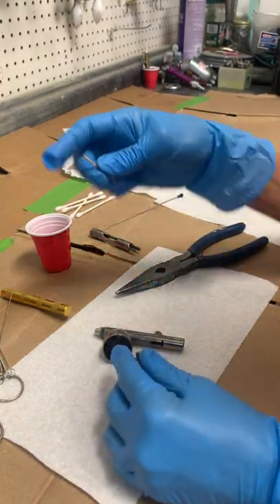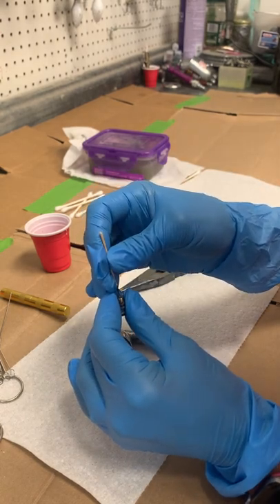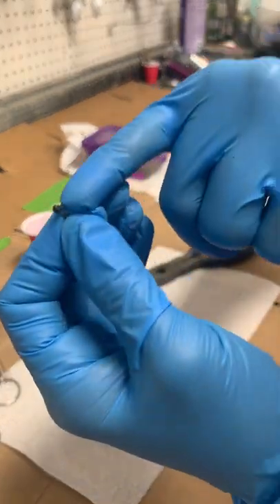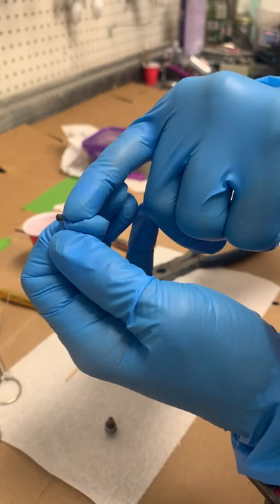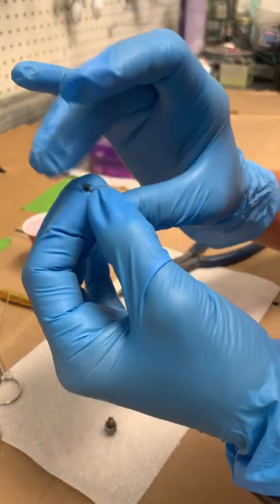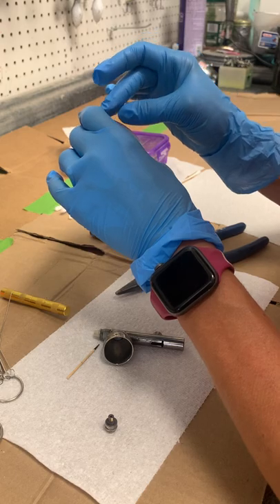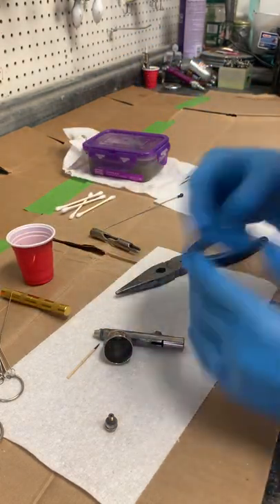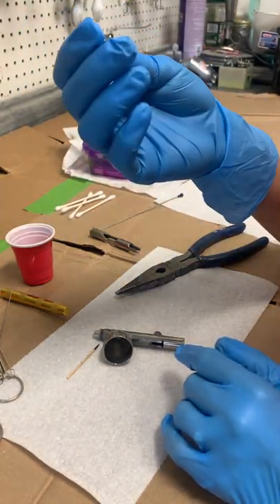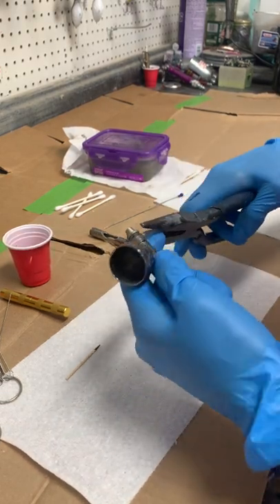Stick the spring and the cover in the cup, then push your plunger mechanism out. If you can't get it to go, use a toothpick and push it through carefully. There's a little plunger seal that'll hold it in place — if that seal is damaged you may need to replace it, available on usairbrush.com. Throw that in the cup too.